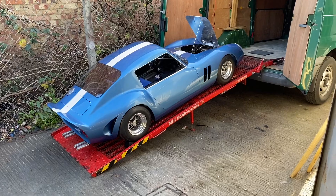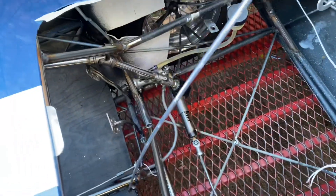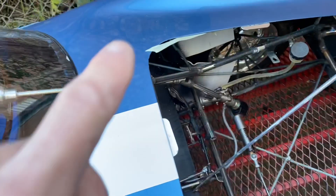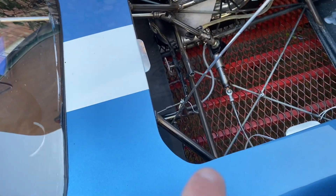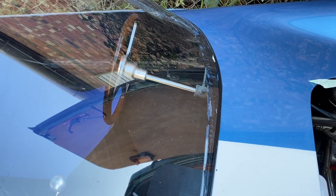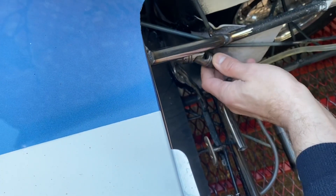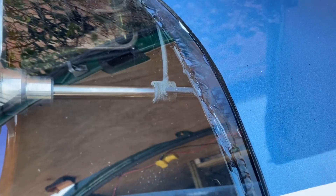Welcome back to another episode. The steering is kind of part way there - you can see I've got the rack in here. I've added some extra bracing across here and round the front, and there's another brace that comes up and across to the body. I've added some UJs on the steering, but it's a bit too far away and a little too high up, so I need to remake that joint and make the tube longer. It has quite a lot of play at the moment because it's only on a single mount.